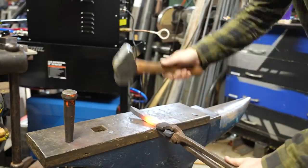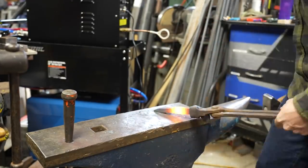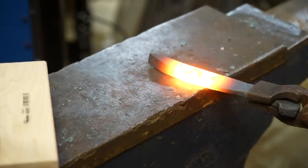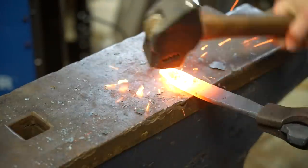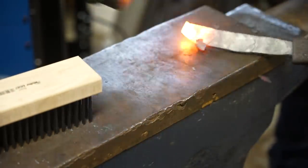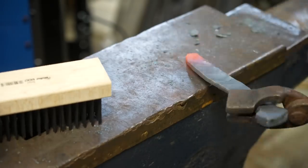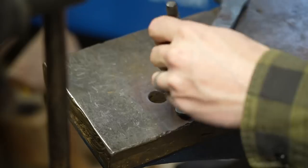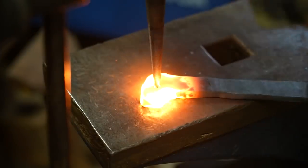The induction heater does a great job getting it nice and hot, and I'm trying to be careful with my hammer blows to make sure that I draw this thing out in kind of the right way. I'm trying to get both sides of the scissor out of this one railroad spike, so I flatten out the head of the spike, and then I flatten out the tip. My thought is that I'm going to make the larger scissor hole out of the head of the spike, and the smaller scissor finger hole out of the tip.